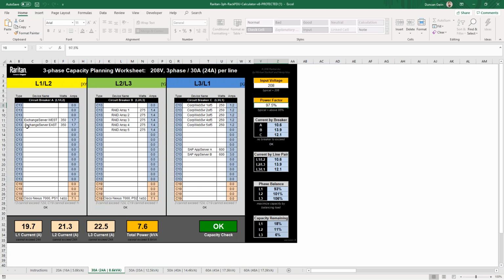You can see the various outlets here. Obviously, your PDU probably doesn't have this many outlets on each phase, but we wanted to give some flexibility and allow you to plug in multiple devices to see how that moves around. You've got C13 outlets, which can't exceed the 12 amp rating, and then the C19 outlets below can't exceed the 16 amps.